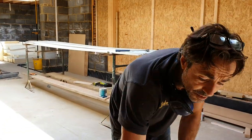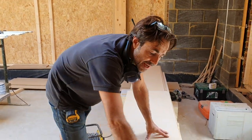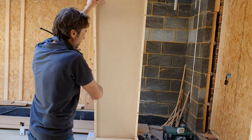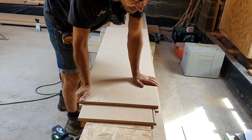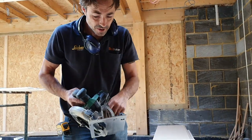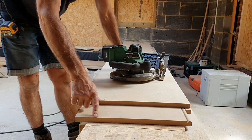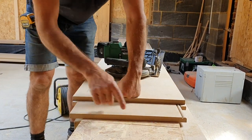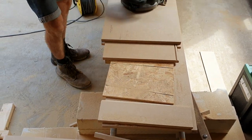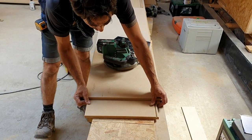On the trestles — or in our case a ladder — we've got a length of our material, the next piece of fascia, and we're going to put a mitre on it. On top of that I've got a section of material with two battens fixed to it, and they sit exactly over this material perfectly. There's a measurement from the side of the base on the circular saw to the blade. Once you've established that with one cut, you add that distance every time. Our measurement here is 122 millimetres to the cut. This is the end of a board so I'll take it a little bit more to show you how it's going to go.